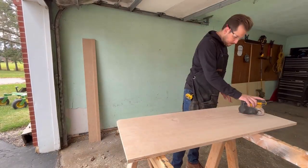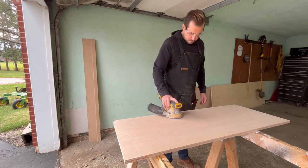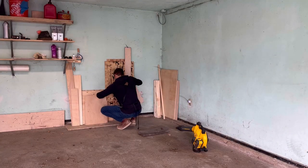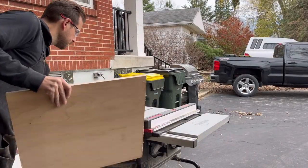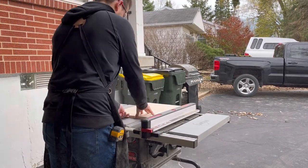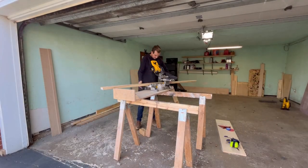I'm working on the bench top here. Since this will be painted, I use 120 grit then move to 180. I found this random sheet of plywood that's nearly perfectly sized for the side pieces. I'm ripping this piece down for the front, and then just batch cutting these two-by-fours.